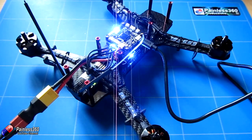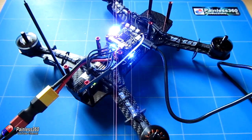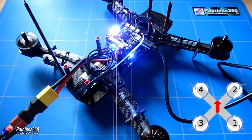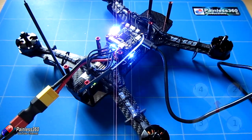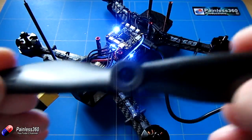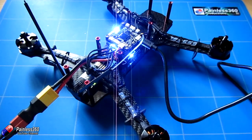I think we're ready to try the motors. Let's make sure no cables are touching, then arm the board and run the motors. They are all spinning great. I recommend getting a piece of tape, sticking it on top, and making sure each motor is moving in the correct orientation we looked at earlier. If any aren't, just swap two of the three wires. I would say that is a successful test.